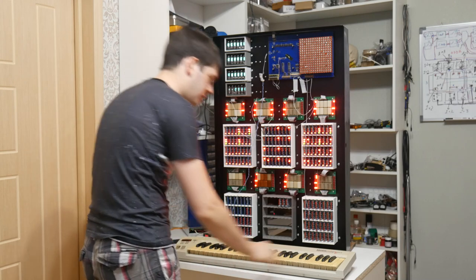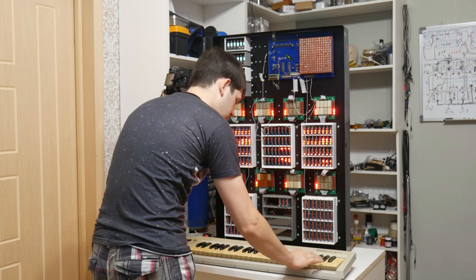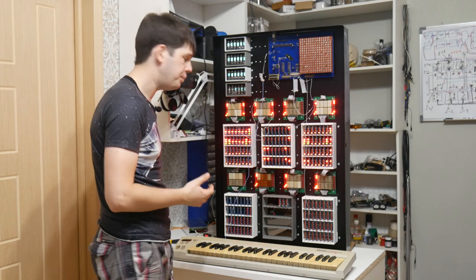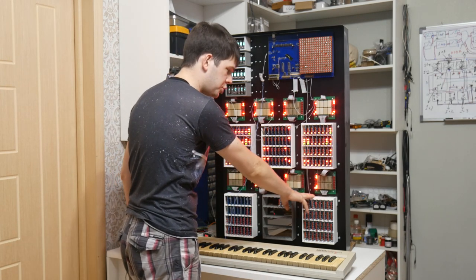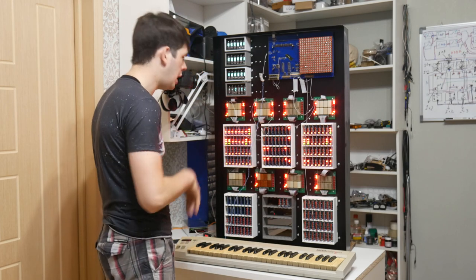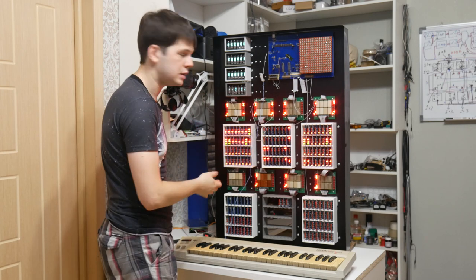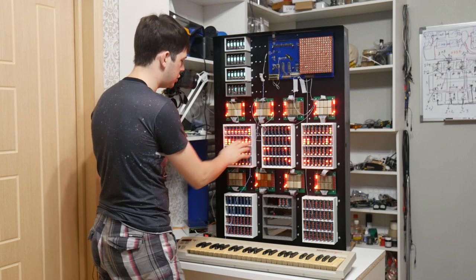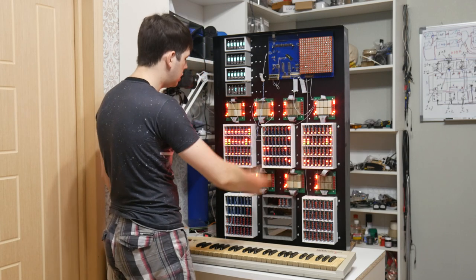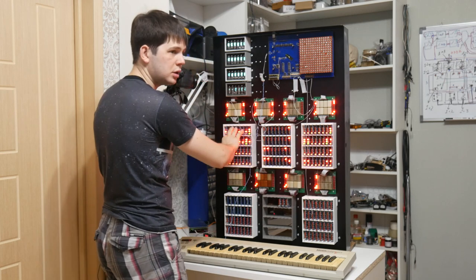And we can play music! Now the computer is not ready yet. I didn't finish the logic block which generates the sequence of signals, but I already interconnected some of the blocks to do increments. So I have a 16-bit input value, a carry-in signal, and a 16-bit output value — doing old value plus 1 and putting it to the output, then setting it back to the input.